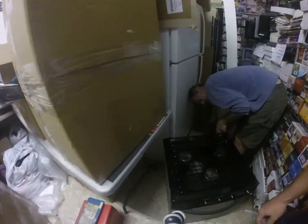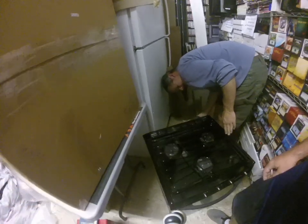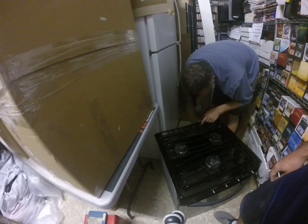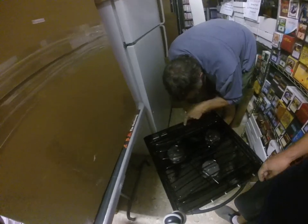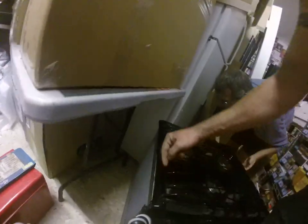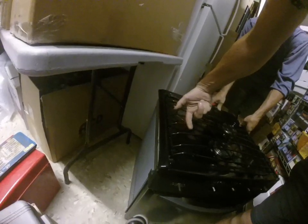I would measure from here down to here — two feet — because this goes up a little bit. This is for your exhaust or your oven. We decided that we wanted the counter to be flush with this and then let this pop a little bit higher than our 36-inch counter.